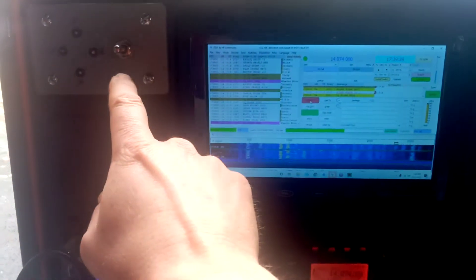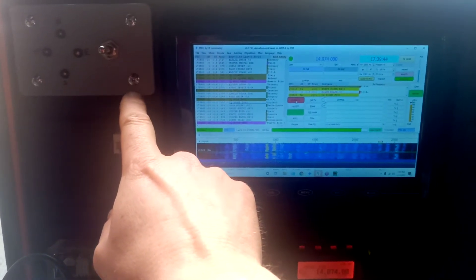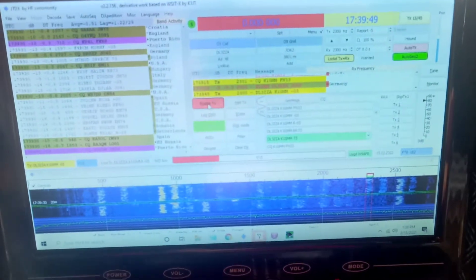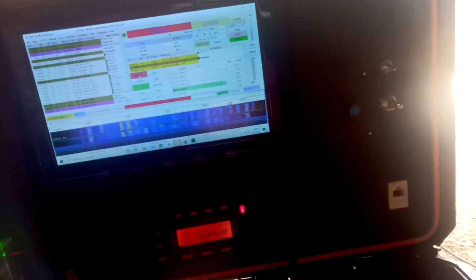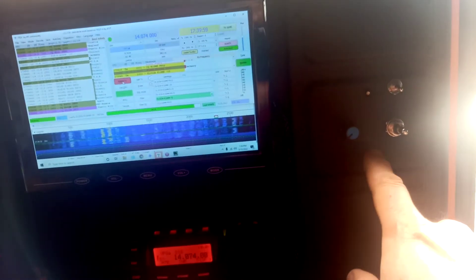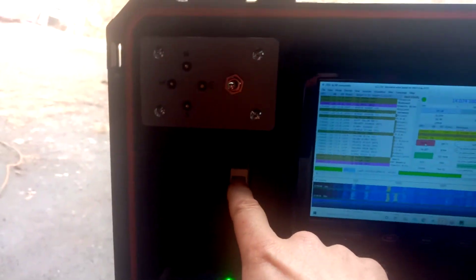This right here is for the rotator when I'm up doing VHF contest work, sprint stuff like that. And we just picked up a Delta Lima. This thing's working okay. This is for the magnetic loop — I also have a 20 and 40 meter modular magnetic loop high power; this is the controller for that, all built into the box. This CAT cable here goes to the rotator, which you guys have seen on my channel. Everything is built into this thing.